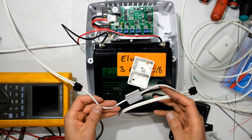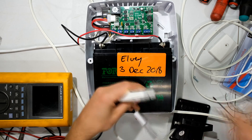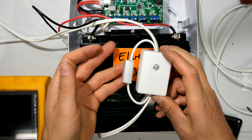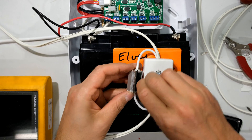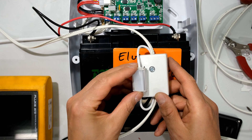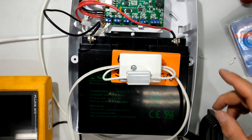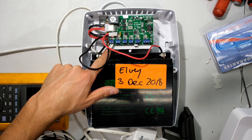You might want to put your connectors in a box — my connectors are now in a box and I can just cover it. Now I can mount this on a wall. I'm just going to stick the sensor on the box using some high-quality double-sided tape. Since this is going to be on the wall and I want the light sensor to have as much access to the environment as possible, I'm going to put it on top of the box. The input comes in one side and the output comes out the other side. Now I'll plug in the mains and the battery, then close the box — the output is going to the day-night switch.